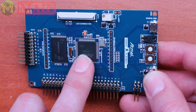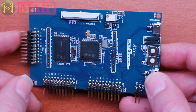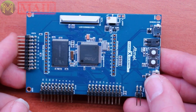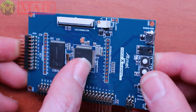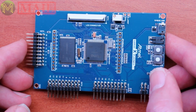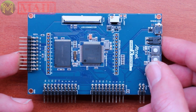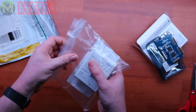Real-time clock. This is a 4S, so it has 79 GPIOs, and also it has hardware debounce filtering as well, so you don't need to add in complex debouncing if you've got buttons and switches, which is nice. It's also got a peripheral pin select crossbar, which a lot of the Atmel chips have these days. It allows you to multiplex multiple signals onto one physical pin, which is nice. But the reason why I got this one is because the quiescent current drops down to 1 microamp, which is really nice. This is a project I'm looking at doing, where one of the basic requirements is that it needs to be extremely low power, running on battery for a very long time. So that was the SAM4S.